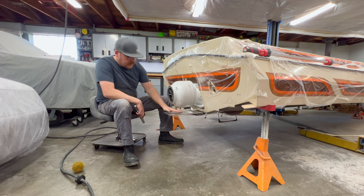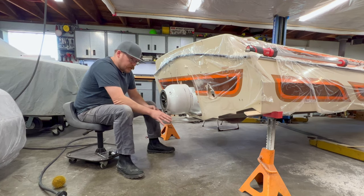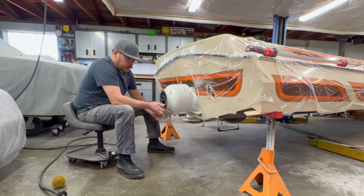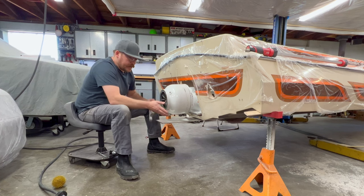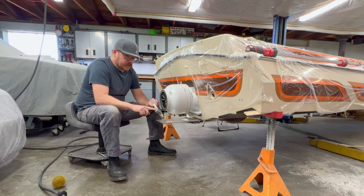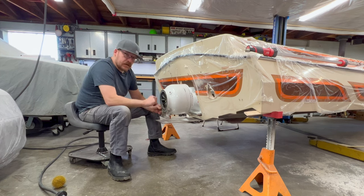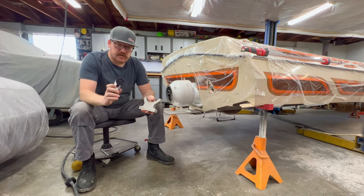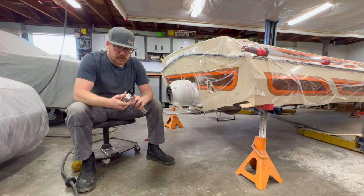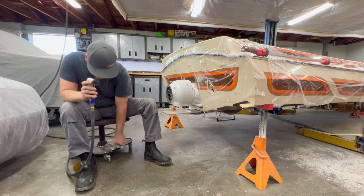We got the pump just set in here — it's loose so I have a little room to move it side to side. I have the shoe and ride plate on, also loose. Now I have the cradle for the bowl. I was planning on mounting the cradle to the ride plate first, getting it centered and bolted up, then using my floor jack to get the cradle up to the bowl, mark my holes, and drill and tap them. However, with this shorter Berkeley bowl, the forward edge of this cradle keeps it from sitting nice up on the bowl — it's hitting up in the corners. So I'm going to go ahead and give it a little bit of a radius to get it to sit flush first. To get this radius on the cradle I'm just going to use this little tool here — it's essentially like a little router for metal, with what looks like a router bit, you can adjust the depth and get a nice uniform radius all the way through.